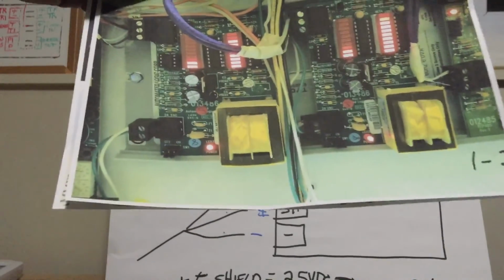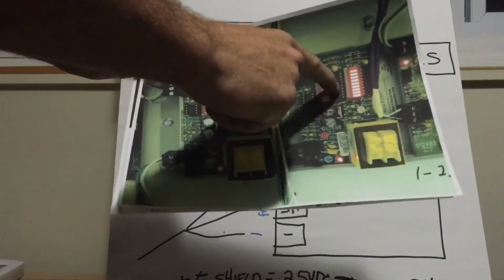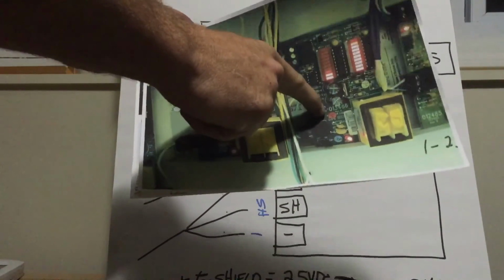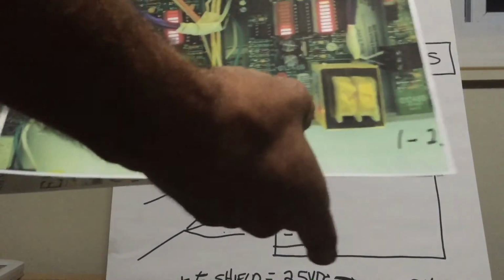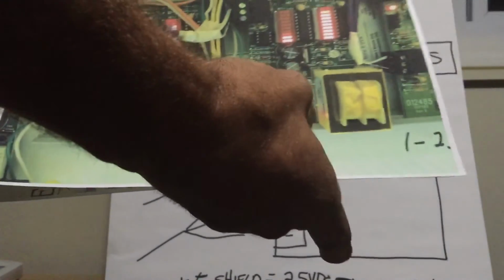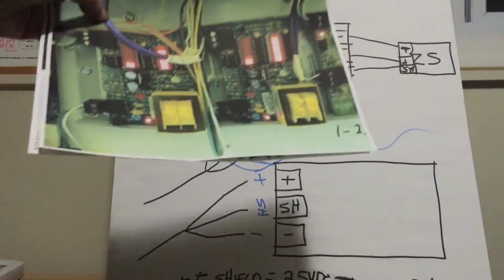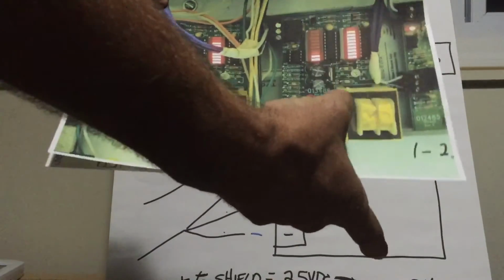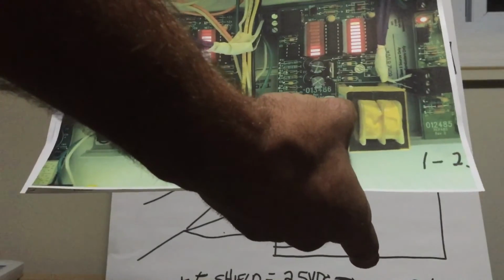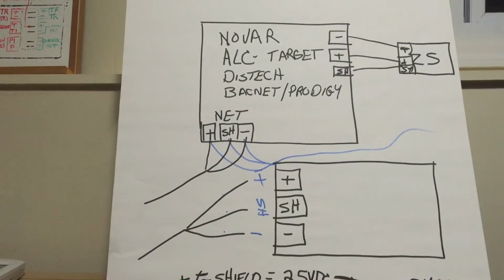get above any noise. If you have a Target with one of these in a rooftop unit and you shut off the power or lose power to that unit, sometimes you can lose the whole store. It'll put a lot of noise on the line. If you get a noise on the line call at a Target, go to the roof and see if you have any units with a diag or a repeater board in it, and make sure the power is on to that unit. If you lose power to this diag on that string, you'll lose the whole string, you'll lose the whole store, or they might not be able to communicate with the store.